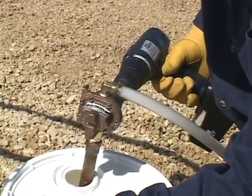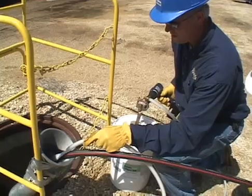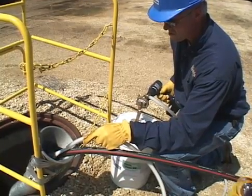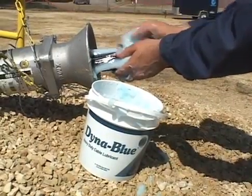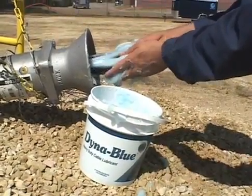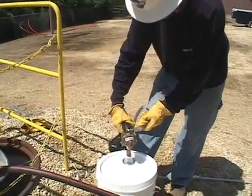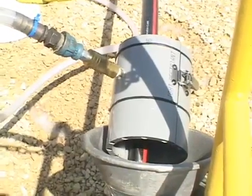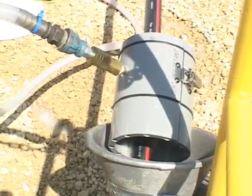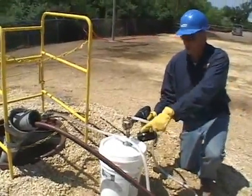The Polywater Pump LPD5 is powered by a quarter-inch or larger electric drill. The LPD5 will pump all Polywater Lubricants except the very thick gel DynaBlue. An extension feeder tube allows the LPD5 to draw from a 5-gallon pail or 55-gallon drum. The pump is supplied with a 12-foot output hose. Vary the drill speed to control the lubricant flow rate from the LPD5.